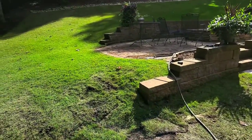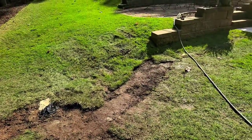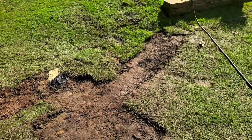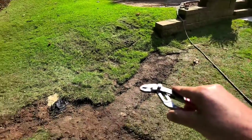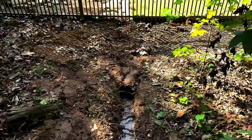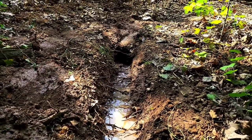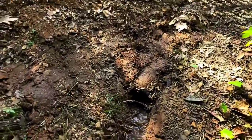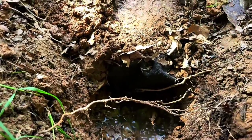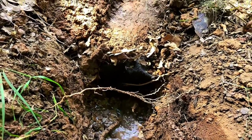We've been running this hose up here for about five minutes to show just what this can do. Before, this whole area used to stay absolutely saturated — now it's not getting past that French drain. We still have some missing dead sod that we need to replace with Zeon Zoysia, which has to be special ordered. There's just a lick of water over here — a little moisture on top of the French drain from surface runoff. Now you can see over there is where we're running the water — there is our water just pouring out of the exit just as fast as it's going into the drain. We also wrap the end of our pipe in the same filter fabric we wrapped the drain in, so we can keep the whole thing sealed, keep animals out, and keep sediment out — so the customer only has to take care of the end.